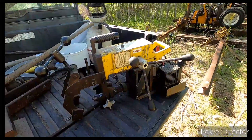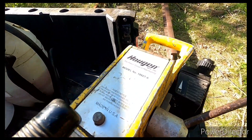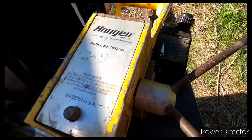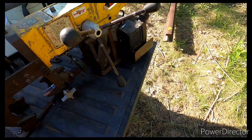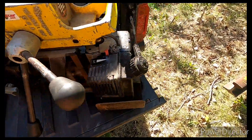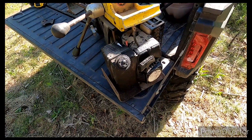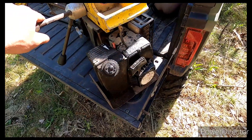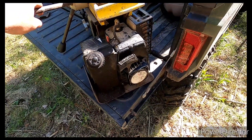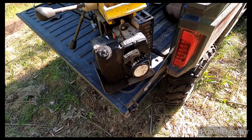This is my rail drill for the railway. I believe it's a Hogan Model 10927A. I love this drill. It's a gas 2-cycle and it's an older engine, so it's one part oil to 25 parts gas. This is not the original engine.